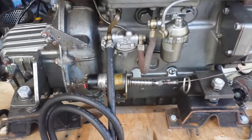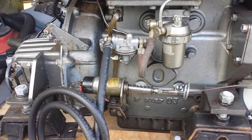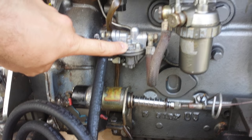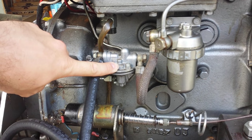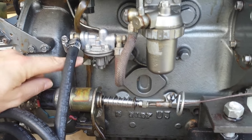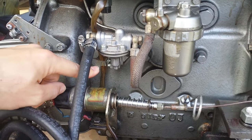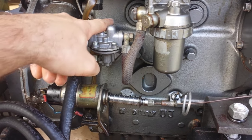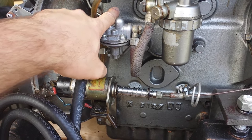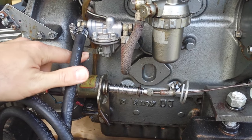In a later video I'll give an idea about how to bleed the fuel system. But just real quick, I want to focus on this — this is the priming pump. It runs on a cam inside the engine. Right down here we actually have the flipper. This flipper operates the priming pump manually. There's an arm that sticks in on a cam, and as the engine rolls it does the same thing, except a lot more times per minute.